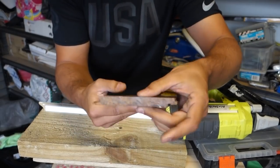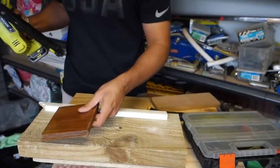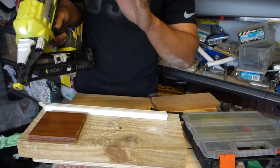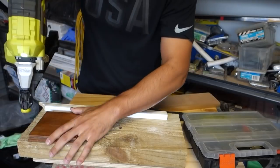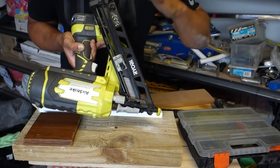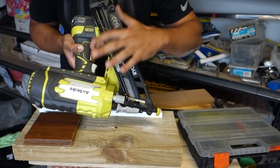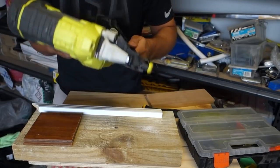Now we've got some solid hardwood flooring. Line that up and nail it down easily. When working with hardwood, just dial the gauge a bit further down to drive it all the way through. The only thing to be aware of when using the nailer is to hold down the trigger until it's fully fired — if you let go halfway through it tends to stall and you have to start over.